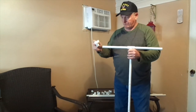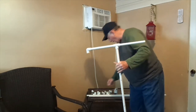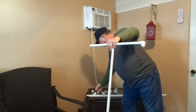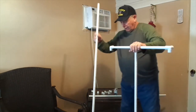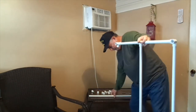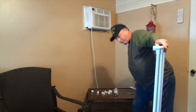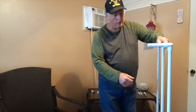I don't know what you call them but you find them where you buy the PVC pipe — put one on each side. Naturally you're going to glue these. Then this piece is also 45 inches and goes on that side, and this is also 45 inches. These spacers are four and a half inches — this keeps the screen away from the antenna elements.